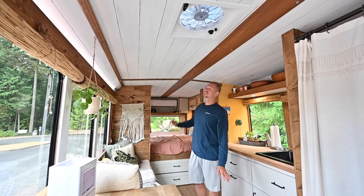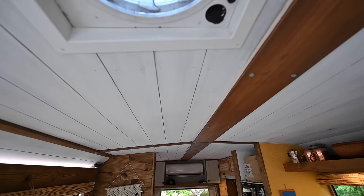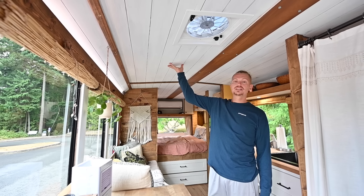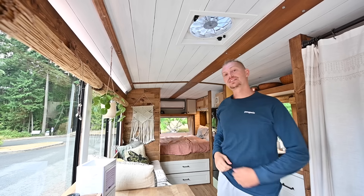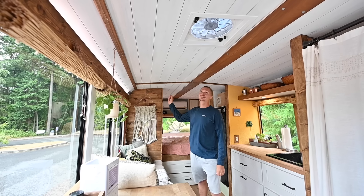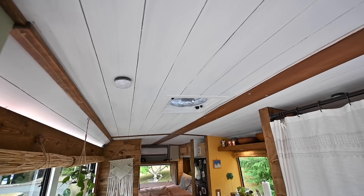For the construction of the ceiling, I tried to keep it as simple as possible. We got this maple for the center beam because we loved the grain look of it. This is just birch plywood quarter inch and I self-cut the grooves in it with a circular saw, just an eighth inch deep. We stained it the same color as the ceiling, and then Sinclair came over the stain with a whitewash, so it gives it that vintage, used look.